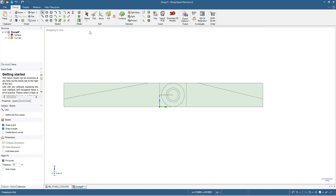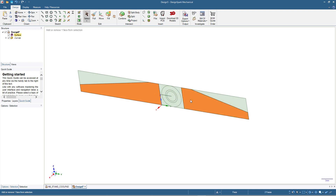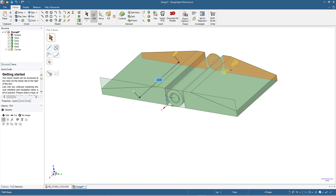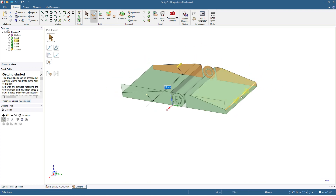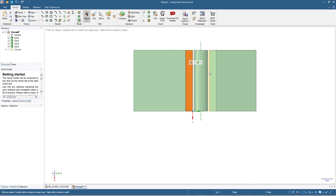After this we will pull or extrude the shapes that we need. I will click the 3D mode, then click select, and click the surface we want to extrude, pressing Ctrl to also select the cylinder surface and the pin surface. Then I will click pull and move to the side by 25 millimeters — close to the size of the double tape, which is 24 millimeters. You can use your own measurement if you want.